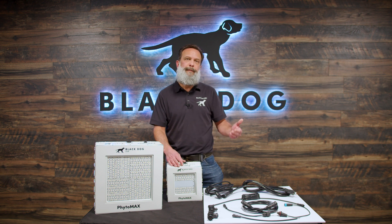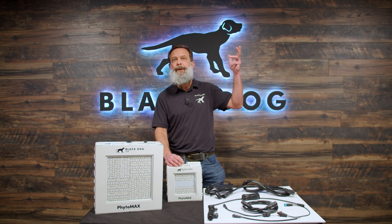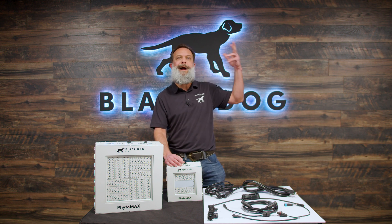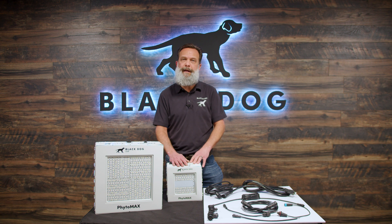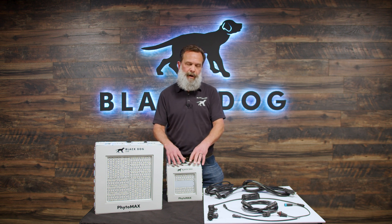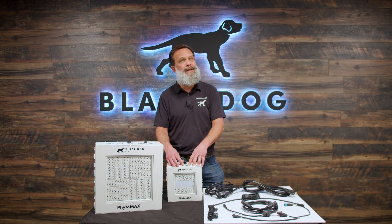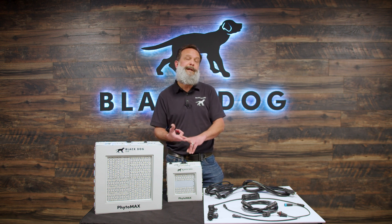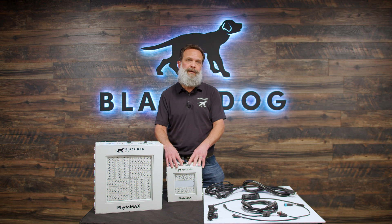They've been developing the rules. LED grow lights are relatively new, and even though horticultural lighting has been around for a while, they didn't actually have a standard — we used to run under the standard for warehouse high-bay lighting. But they finally realized horticultural lighting is here to stay, especially with cannabis legalization across many states. So they've developed a horticultural lighting standard with tighter, safer rules. To be clear: UL or ETL standards are about safety — it doesn't mean a fixture grows well, just that it won't burn down your facility.